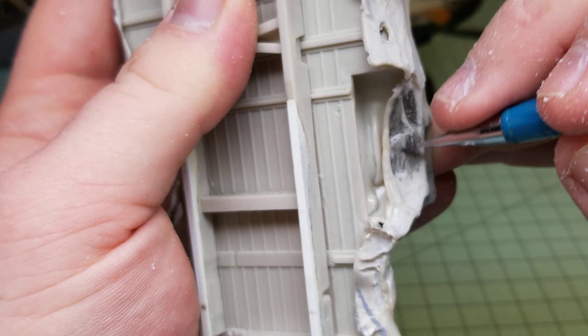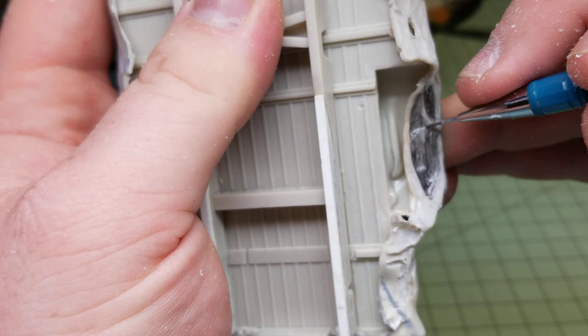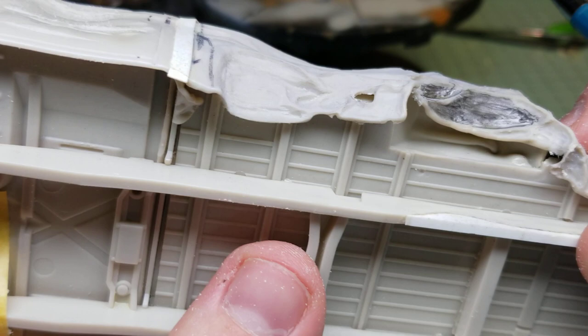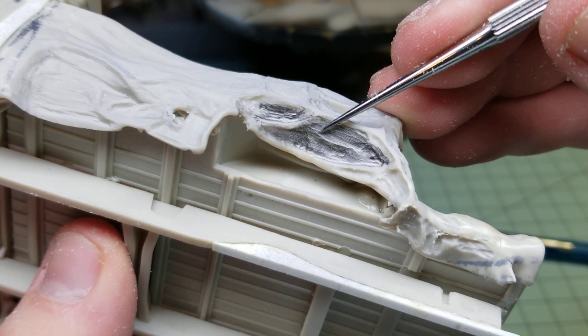Those of you that have any sort of machining experience will know this trick. You cover something in dye, make a couple passes on it, and you'll find out real quick if it's square or not. Fill in, and that's also kind of the same thing as hitting it with primer. And you can see that there's textures and tool marks in here I need to get rid of yet. See how it's kind of bumpy?